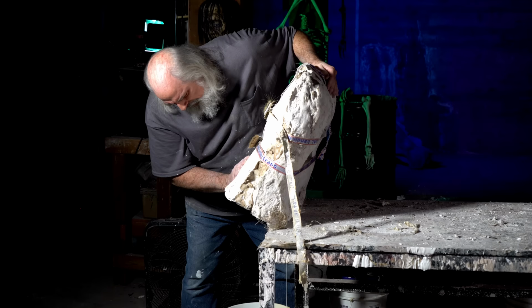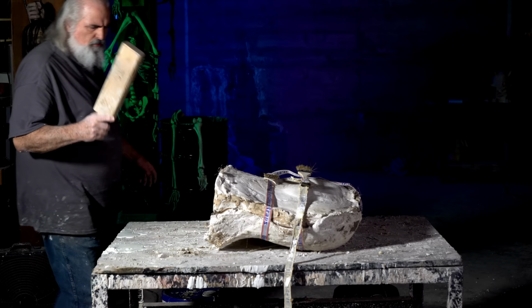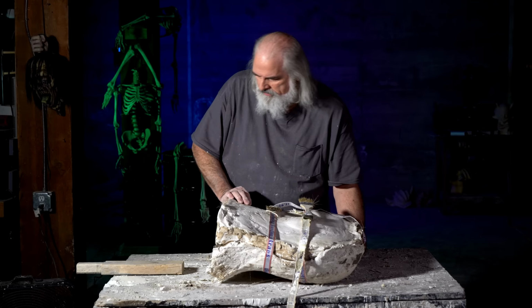So when you get most of it off, then you want to let it set totally upright. Now, I would get a 2x4 or something, because if it sits flat on the table, it starts to set up, and then you go to pull it and the table rips it out of the mold, and of course your latex is not cured, and so it will ruin it. So it's better to have a little something to lean it against so that they can finish draining.